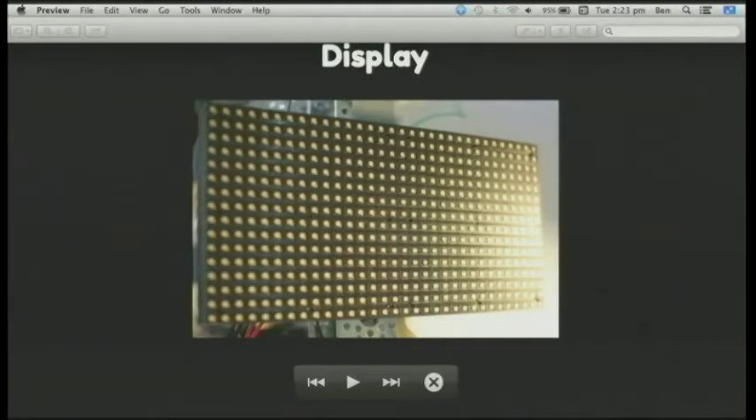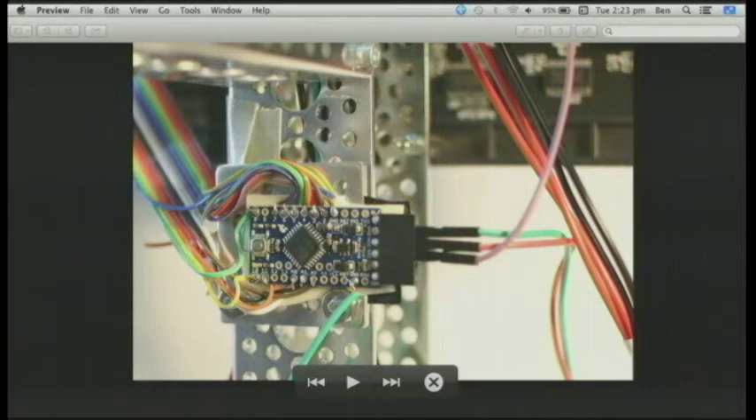The display I got for about $20-25 from SparkFun. Everything in robotics has multiple ways of doing it and a lot comes down to your budget. In behind the display is a 328 microcontroller which is hardwired to the display because you have to keep pulsing the display to get the colours — you can't just say 'here is an RGB value, I'd like that pixel to be that RGB value.' You have to do time-splicing, turn it on a certain amount of time and turn it off to generate your perceived colour. Having a microcontroller that's just sitting there doing that for you is incredibly handy.